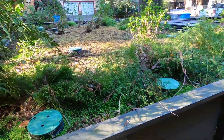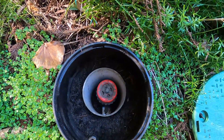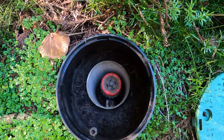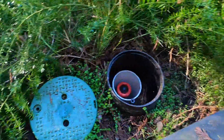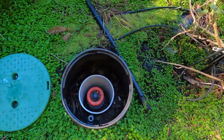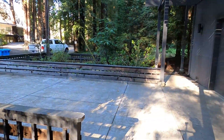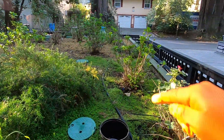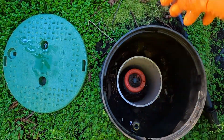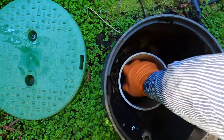I'm standing at the back of the sand filter at the balancing valve boxes — I know that because there's simply a gate valve to be seen at this end. I'm going to pull the lids off. The whole idea of purging is to consolidate all of the pump's pressure and flow to one lateral at a time. Watch out for some of these spiders — brown recluse maybe. What you need to do is shut down every lateral except for one.